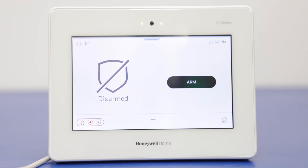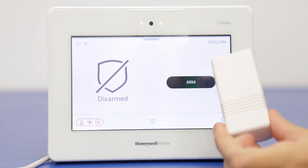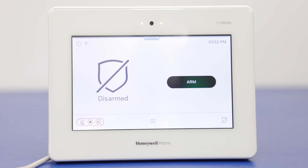So we have our Pro Takeover module installed into the panel, we have the dial set to zero, which is how it's going to come initially — and again, that is for Honeywell 5800 series sensors. For the sensor itself, we have a 5816, which we're going to get programmed to the system.